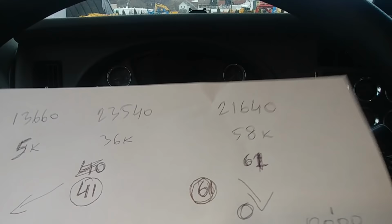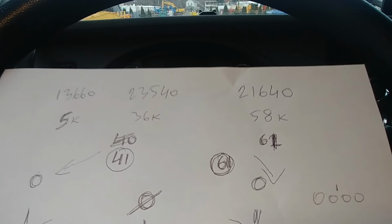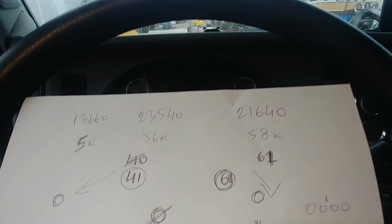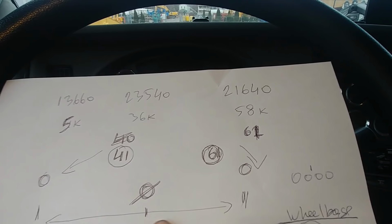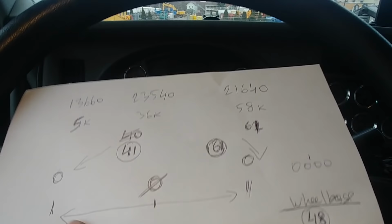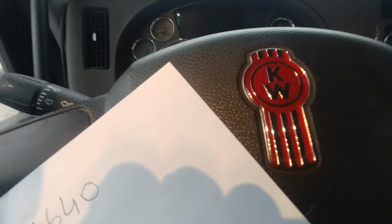And so, yeah, we have to have 41 here and 61 there, which means the center of mass cannot be in the middle. It cannot be at 24 feet, like 48, right? If it's 24, then it'll split 51 here and 51 here. That's too much for the truck, not enough for the trailer. So I calculated it has to be around 29 instead of 24. So like 4 feet towards the trailer, away from the kingpin. So kingpin to center of mass, 29 feet. Okay, got it? Clear as mud?